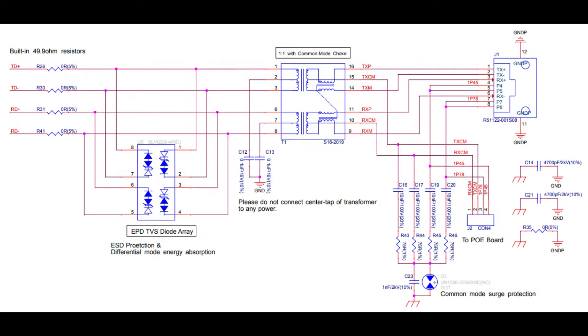Once you've got that — for example, the ESP32 has the built-in ability to do Ethernet — you can't just connect it directly to the RJ45 jack. You need to have a magnetic transformer in between to balance the output because it's a differential output. You also want to protect it because the cables are really long, you have exposed wires, and you can have high voltages and spikes coming in. So you want to clean up the signal and also have electrical isolation. Ethernet should not be earth-grounded — because the cables can be so long, there's no guarantee what ground is on the other side. They have full isolation inside using transformers that also sometimes do level shifting because the signal is plus/minus 2.5 volts.